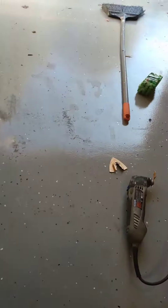I ground this whole floor first with a floor grinding machine I rented from Home Depot, and it's still happening. Two coats of epoxy, one coat of clear coat epoxy — three coats total. This is a product from Sherwin-Williams that supposedly doesn't need a primer.